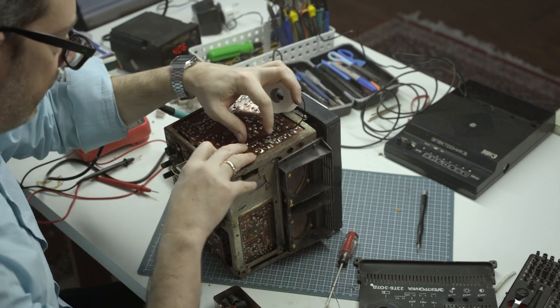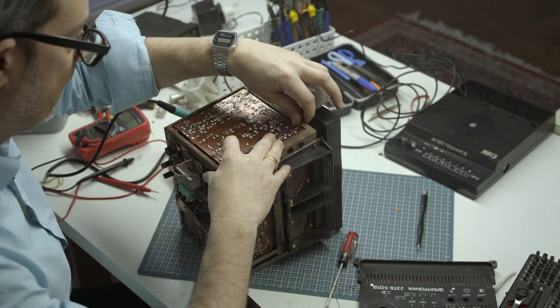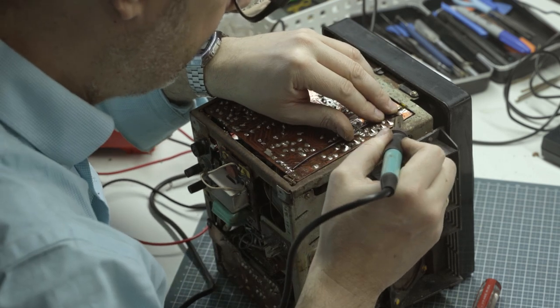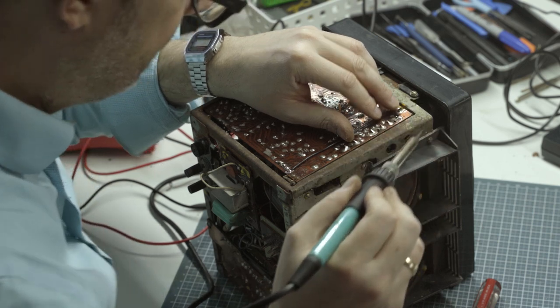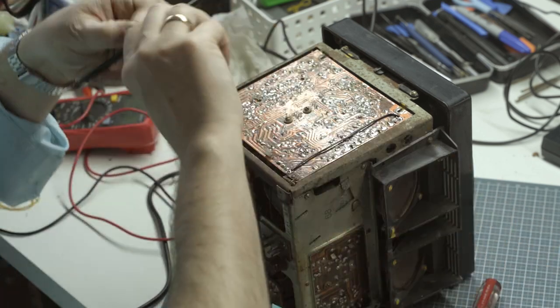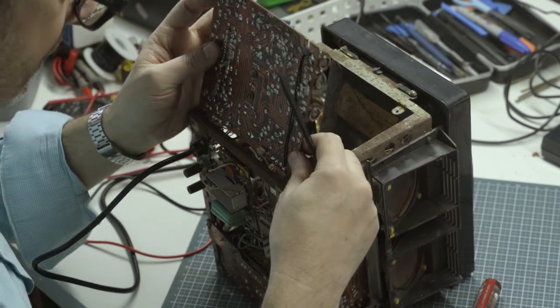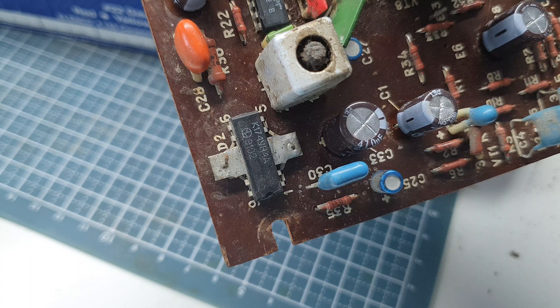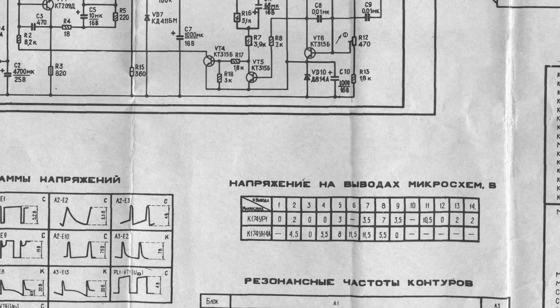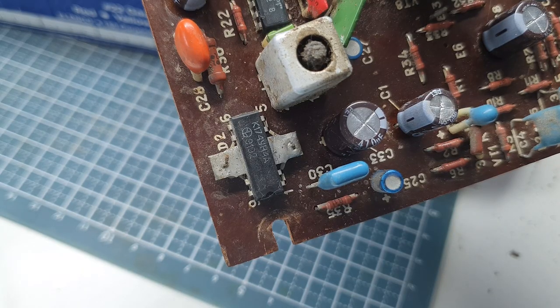Let's see what we need to do here. Why don't we just run the bodge wire all the way across — maybe it's totally unnecessary, but there are no easy answers right now. Let's start ruling things out. We could test the voltages on these ICs. The camera cut out, but this is one of the ICs in the area of the circuit that deals with vertical deflection, and the schematics give us voltages for what this should be.